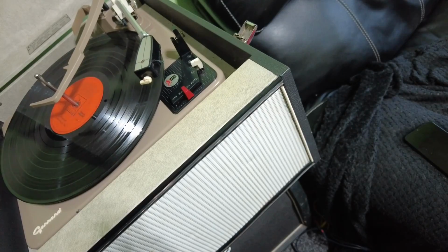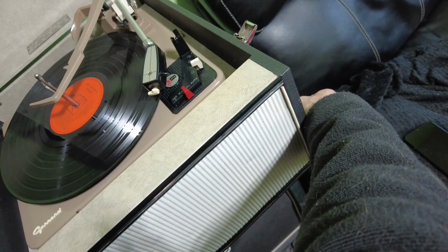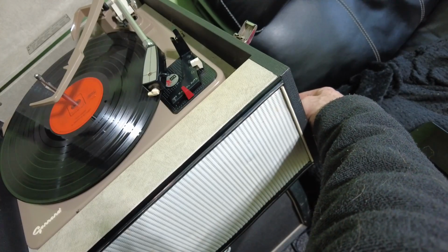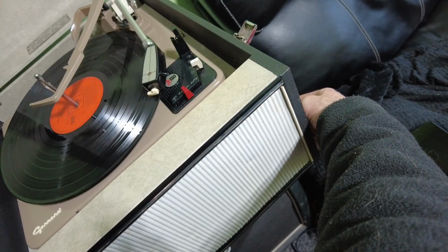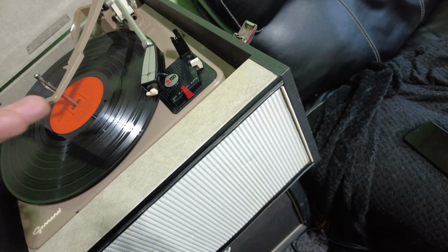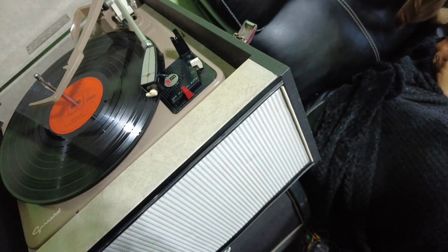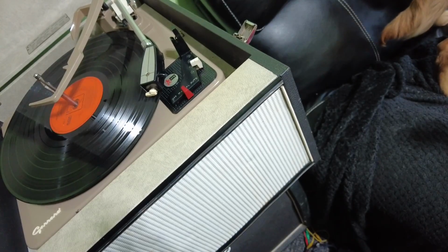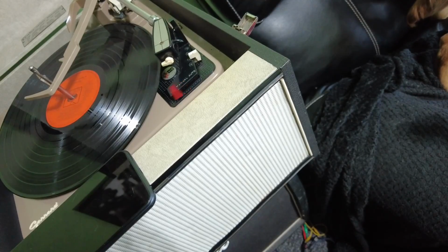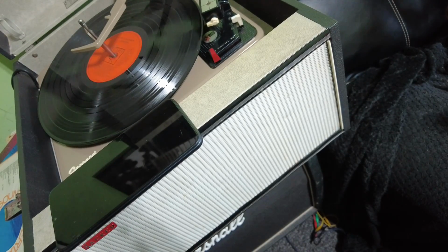That's better. How loud that is, this thing is ballistically loud. I can't believe it was as loud as that when it was new. So again, by removing that EZ80, we've got a bit more HT now, a bit more punch, and also we put those 1.5k cathode resistors in instead of 2.2, which will give us a bit more gain on there. So I used the phone so you could have a listen to the quality of the actual amplifier, and just use that record there to demonstrate the volume, because we didn't want to get a copyright strike.